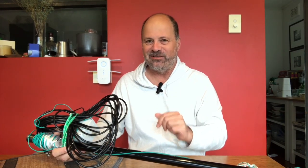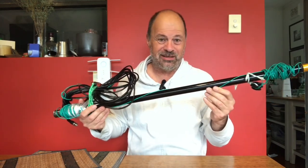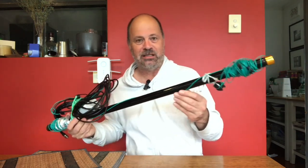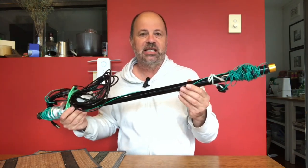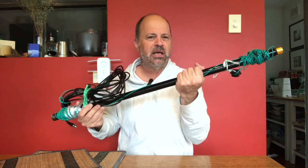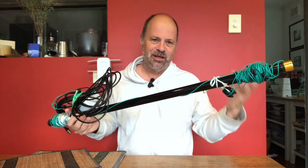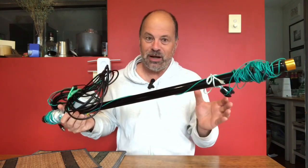We now have our antenna complete. It's quite obvious this is not the sort of thing you're going to stick in a backpack and take to Summits on the Air — you're not going to trek up a mountain with this. It's quite hefty. But that's an opportunity for another project. You can never have too many antennas, never too many projects — that's why I do this hobby. I like to make stuff and take you along to see my bumbling efforts. This squid pole, the Chinese-made one — time will tell just how reliable it is. I noticed on the Haverford pole that at each section there is a metal sleeve. Carbon fibre is really strong — stronger than steel — but it can be more brittle, so we may have problems with breakages at those intersections. Time will tell.